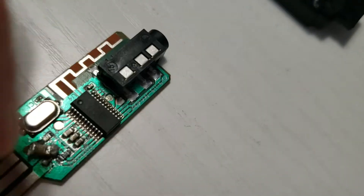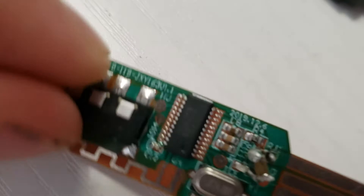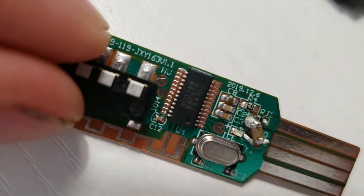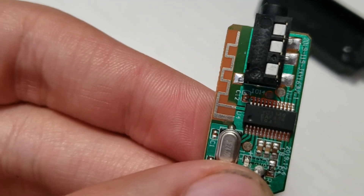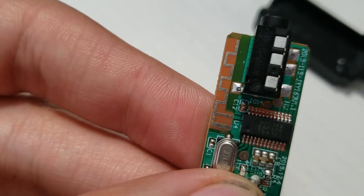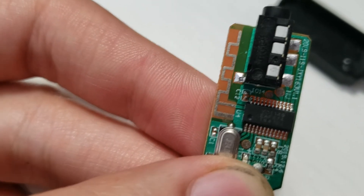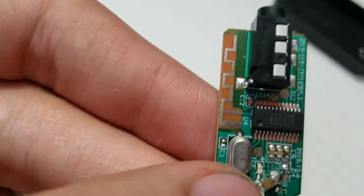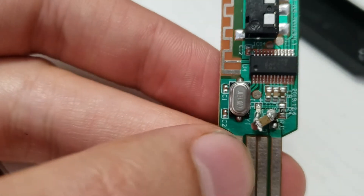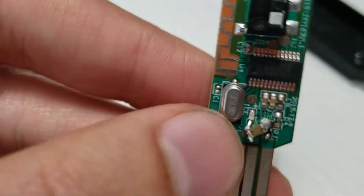As far as the markings on this go, you have one right here: JXY 163 version 1.1, some late 2019 date codes, and the one little chip that does all the work — board YC1149 EAF 374 1941 DJ. There's obviously a Bluetooth antenna, the headphone jack, the chip, a small crystal oscillator, a handful of caps, an LED resistor, and a zero ohm resistor down there. That's it — it is as cheap and simple as they come.